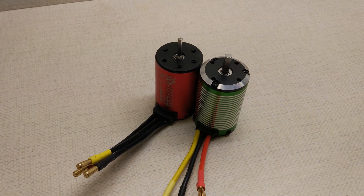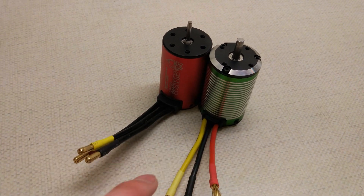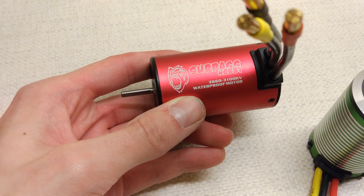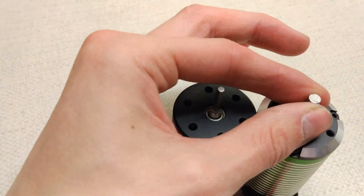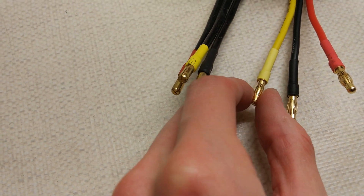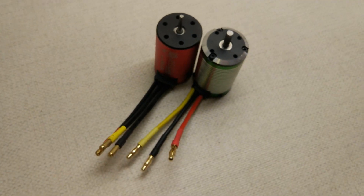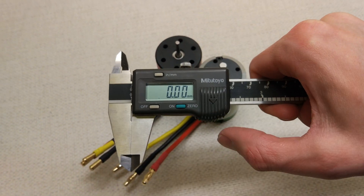As a new feature on these Motor Test Tuesdays, I'm going to improve my testing a little bit by doing a quick physical comparison of a similar spec motor. So this one here is a Surpass Hobby KK series REDCAM, 3660 3100 KV. It's only got a 3.2mm shaft on this whereas this is a 5mm. The main thing I'm going to do is tell you about the wires, the type of connector, and also the exact dimensions of the motor, to see if these ribs make a difference. I've got my calipers here and they should be zeroed out — which they are.